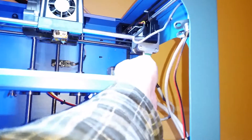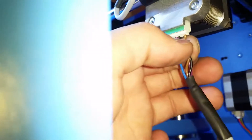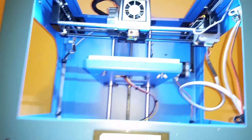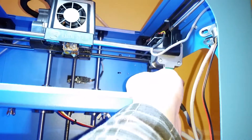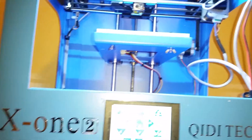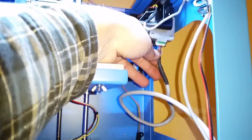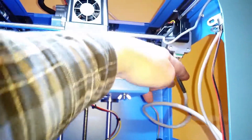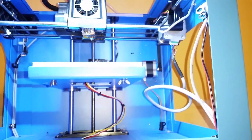It's still not working. Give it a little wiggle, make sure these cables are seated well in their slots. Let's try again — still not working properly. So in the end, we know that this cable is bad somehow. If this is what you find, just buy another one of these cables — they should be about five dollars — swap it out and you should be good to go. Thanks for watching.